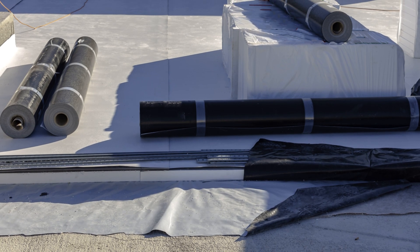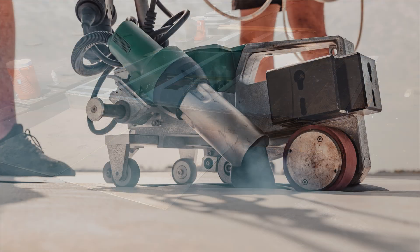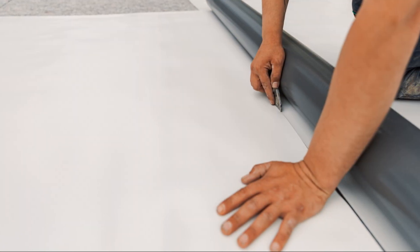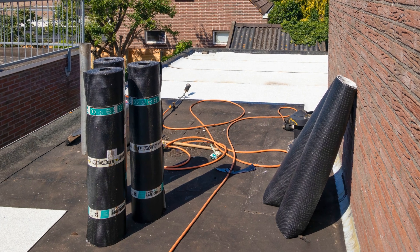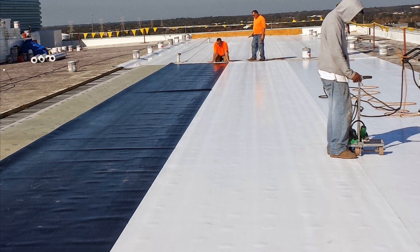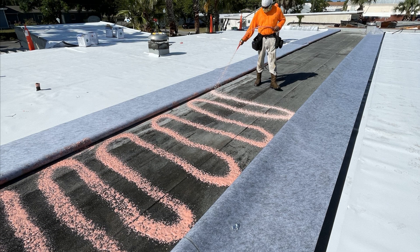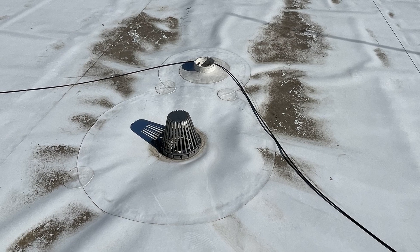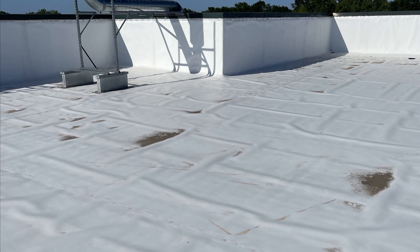This last detail is for flat roof terminations — specifically single-ply membranes like EPDM, TPO, and PVC, but it's also applicable to some modified bitumen membranes — at roof-to-wall transitions. The roof membrane needs to be installed on a compatible substrate, and we want to make sure that we're using an adhered system so that the membrane is bonded to the roof assembly. We don't want a mechanically fastened system since both water and air can travel freely underneath and you can get bubbling and blistering.